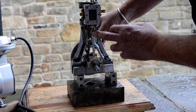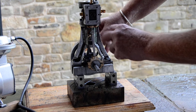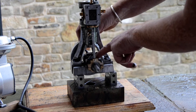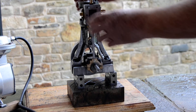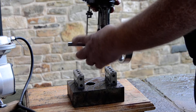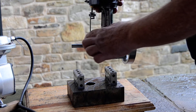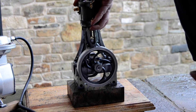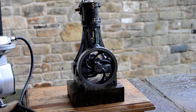The eccentric rod and the connecting rod — I'm going to tidy those up a little bit, put a taper in the rod, and it needs shortening and rounding at the top. It needs a few oil cups making, and possibly one there as well. There's a fair bit to do yet. I want it mounted on a base with an outrigger bearing and a little pulley to drive something — possibly a pump — but I'll see how it performs once I can get it piped up and running on steam.